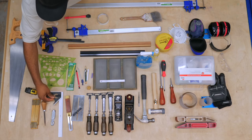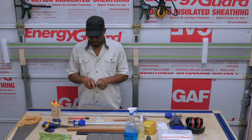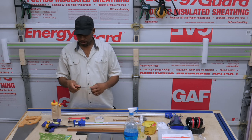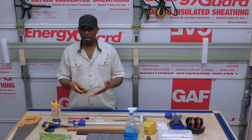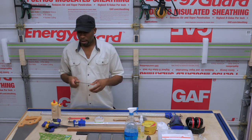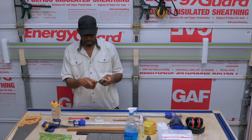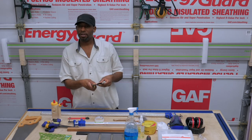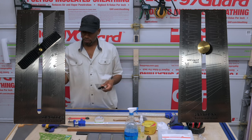The 45 is a very common angle that you're going to use a lot. For various other angles, this bevel gauge comes into play. You can use this to duplicate a bevel — like if you have an existing angle you're trying to match. Along with the bevel angle plate, you can use this to come up with specific angles, set it to that angle, lock it down, and use it in your layout.